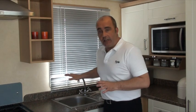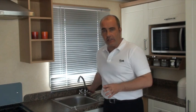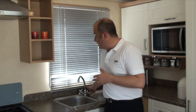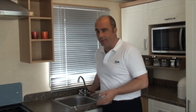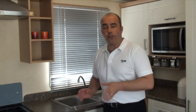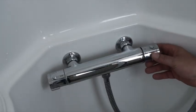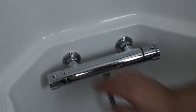We did include this in the using flow section but I want to cover it again. Whenever you've been doing the drain down, you've been opening and closing taps throughout the process, letting water out and then sealing the system again. When you're finished, leave all of those outlets in the open position, both hot and cold. For your shower, leave the mixer valve set in the center and leave it fully switched on — that allows both the hot and cold pipes to let air through them.